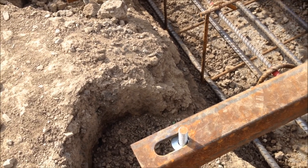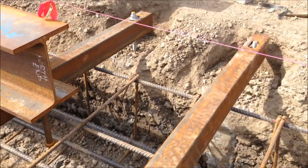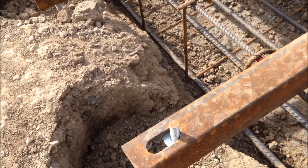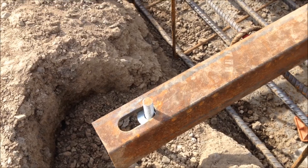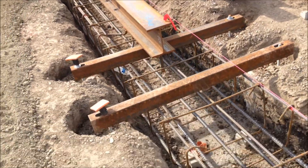but then we realized it was important to have a slotted hole. The slotted hole allows us adjustment when placing these spreaders. So in summary, instead of field cutting the holes, we cut them in our steel fabricator shop — it saves us labor in the field and it's safer because we don't have to use a torch.